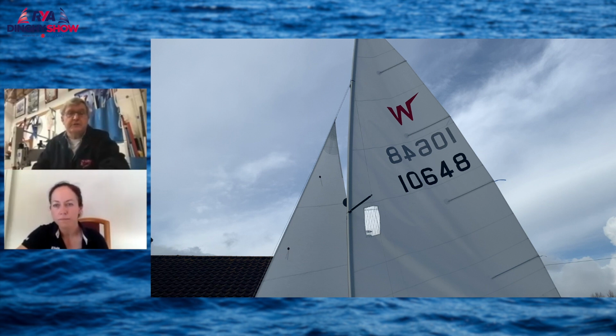We've got luff creases in the mainsail, which we'd need to take out with the Cunningham. Because we've bent the mast, what have we done to the height of the jib halyard at the top there? We've lowered it down. So any good intentions to have 350 pounds on the windward shroud, now we're on the water, all of that's gone to pot. What will now happen is that 350 pounds will be much less.